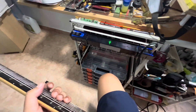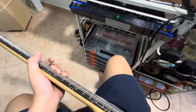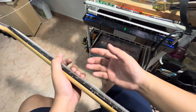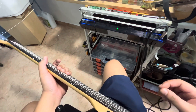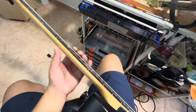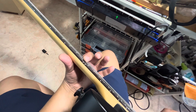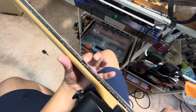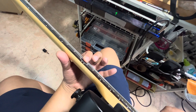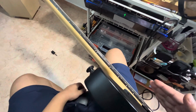Slightly a bit more, but overall I think there's a very drastic change in tone and intonation. I don't want to raise the action a bit higher, and here's why: if I bring the string a bit higher and it's tuned to G, because the distance is very far for me to fret down, even if it was supposed to be G, the extra height will sharpen the note even more.